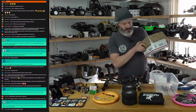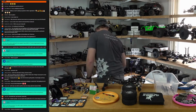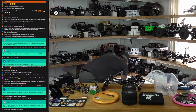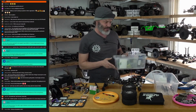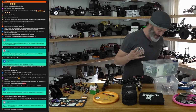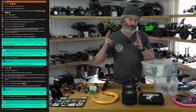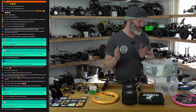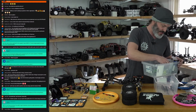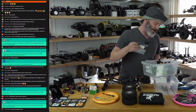Motor turns are, by definition, the wrap of each wire around a pole, and that pole could be considered as part of the stator. There's a thing called pole pitch. So on a stator that's a 12 slot with, say, a 4 magnet, you got 4 magnets, 12 slot stator, your pole pitch is going to be going over, if you do a full pitch winding, you're actually going over 3 different slots. So your full pitch turns are what defines the turns of a motor. All right, I'm going to start getting off track before I even answer the question.